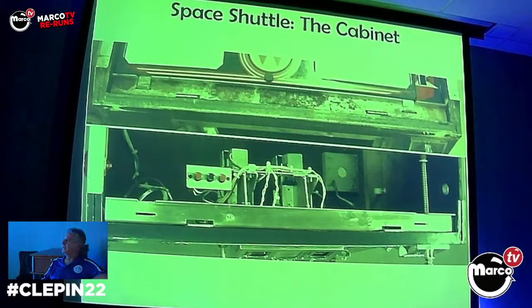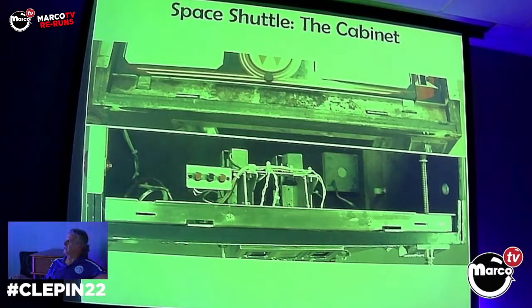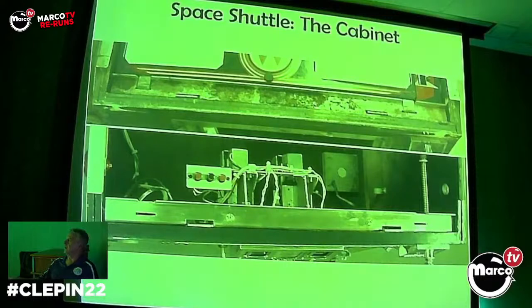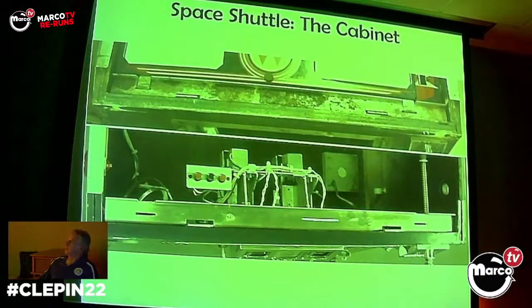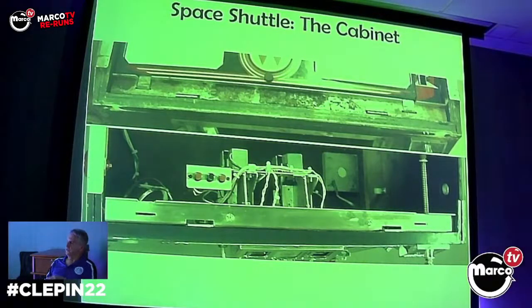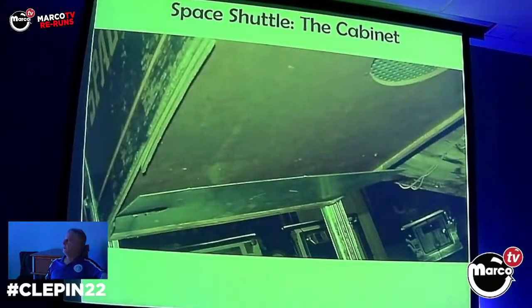I start with another one, and you use a really brand new one, and you get that nice finish on there like that. You don't sand it a little bit, like work over here and then work over here. You can start that way if you're getting the worst of it out, but then when you're starting to put the final marks on it, you want to go from end to end with your sandpaper and your Scotch-Brite pad. Works really good.